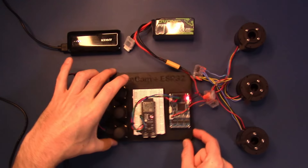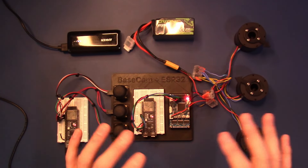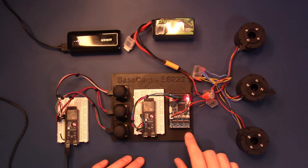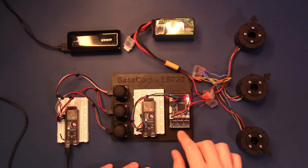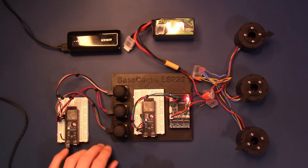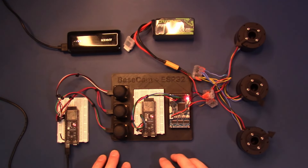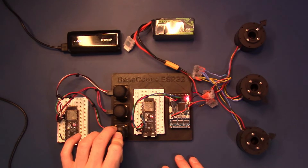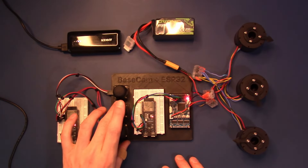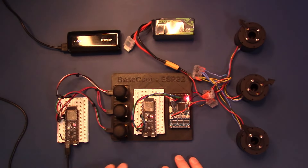Between the three axes they are fairly responsive. If you can imagine these mounted on a motorized gimbal, they would be trying to react to the inertial measurement unit of the control board. You can also have an external IMU if you wish, but this board has a built-in IMU so I'm using it for the demo. The secondary control mode is by setting the angle. After resetting both ESP32s to establish the Bluetooth connection, each joystick sets the angle for one axis — yaw, roll, and pitch — all done wirelessly through Bluetooth Low Energy.